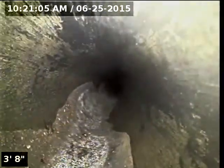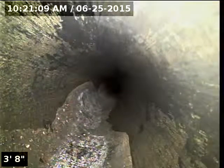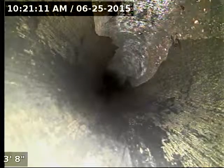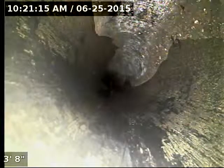We're located inside the crawl space. There is a three inch ABS clean out — this will be the point of access. I'm going to insert the camera and check the overall condition and serviceability of the sanitary sewer line. I will zero out the camera right here and refer to this as the point of access.